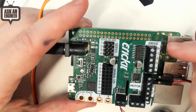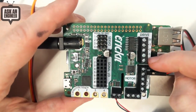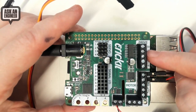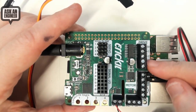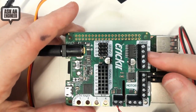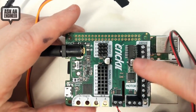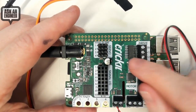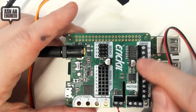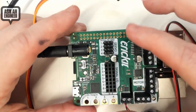There's a four-pin drive output where you get five volts and then four Darlington outputs. So you can drive solenoids, unipolar steppers, or some basic high-current devices like high-current LEDs. This will do high current drive up to half an amp per output with a Darlington transistor and a kickback diode, so you don't have to worry about solenoid voltage coming in and damaging anything.